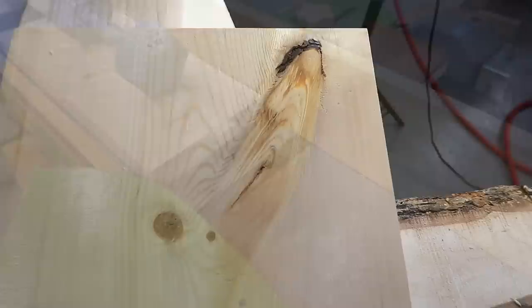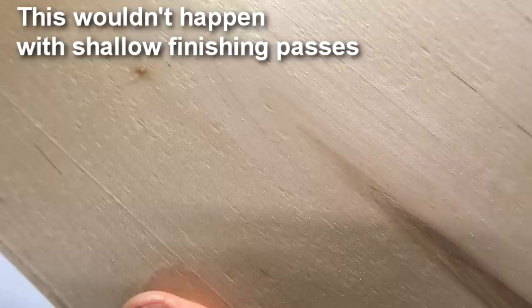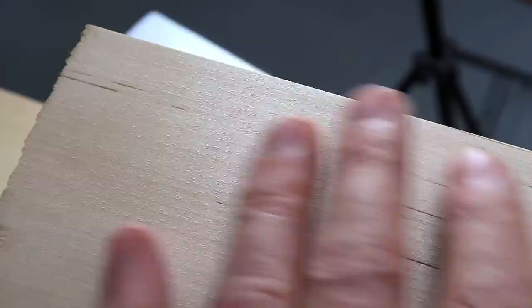And here's the after — still some tear out but overall pretty good; it's hard to tell the difference. On another piece you can see the speckling from chips quite a lot and the lines from the nicks. And here's after — we see some faint lines across from the cutters, and with the light across we see some lines along from the cutters not being perfectly aligned, and some slight scalloping because each cutter makes a bit of a scallop. Some roughness along here that does feel a little bit rough. Total power for this cut was 2000 watts; previously I did it with 1200 watts. But the increase over idle was 1400 watts whereas before that increase was 750 watts, so the actual cutting action takes nearly twice as much power.